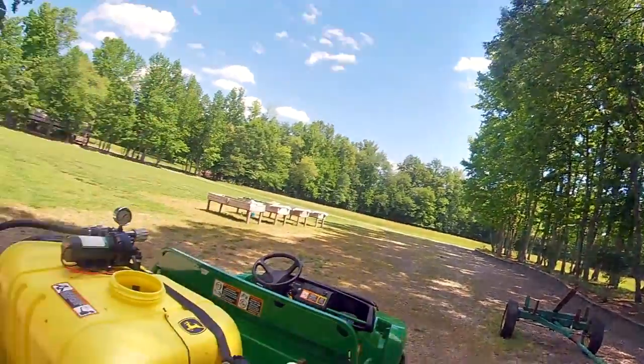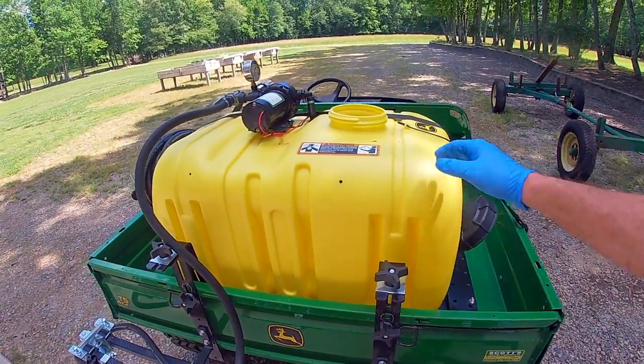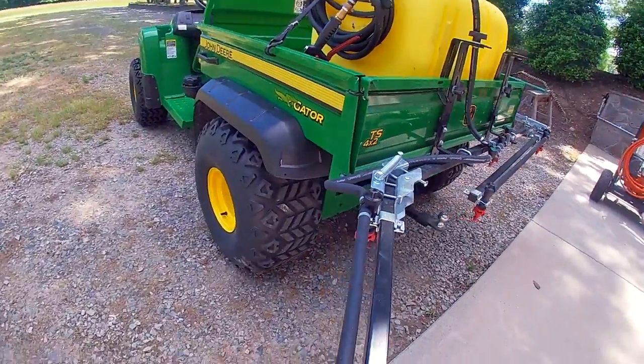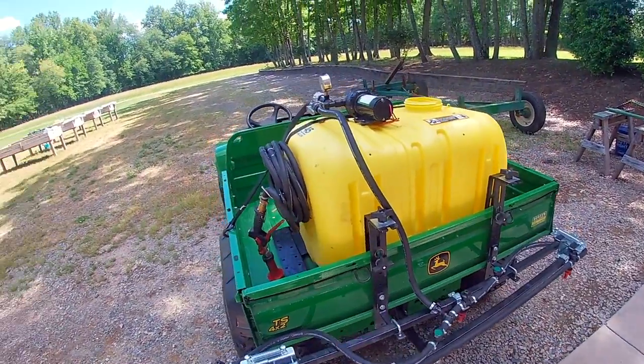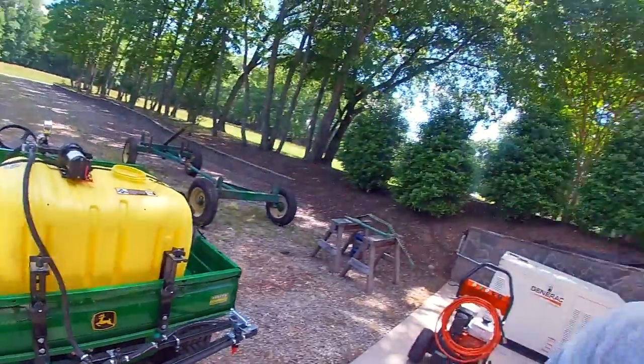One of the things I invested in a few years ago, because of the size of my property, is a John Deere 45-gallon tank with a boom that extends out like so. I don't want to kink my hose line. I have five spray nozzles, and my boom is 10 foot wide. With the spray nozzles, I am shooting a path about 12 foot wide.